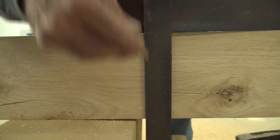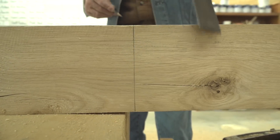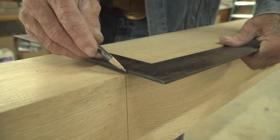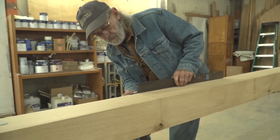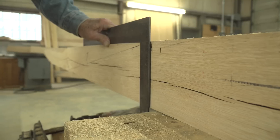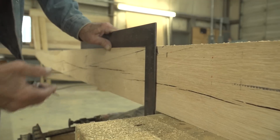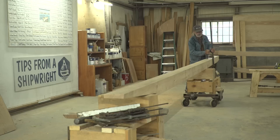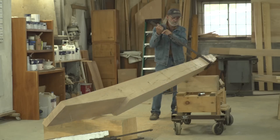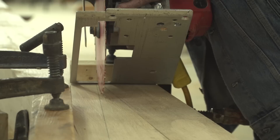Once I've got the timber squared, I can take a framing square and make a mark all the way around it and see if it joins up on the other side. If it doesn't join up on the other side, something's wrong — and you can search it out and find it. The idea is to get it the same thickness, nice and square, so that I can draw this line on the other side. It's very simple — you don't just pick up a saw and cut it. You have to know exactly where you're cutting and it has to fit the other timber. So time to be careful right here.